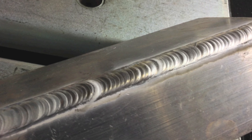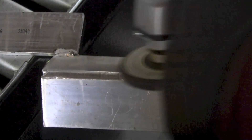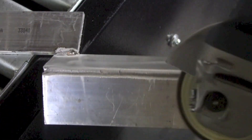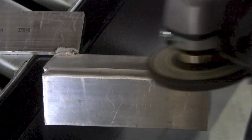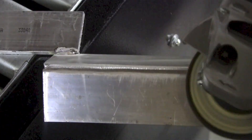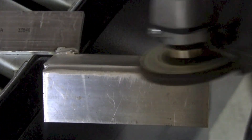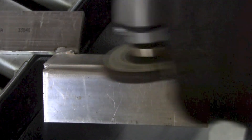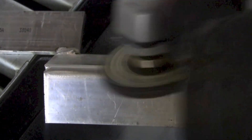There's the weld, and there's a restart about two inches in from the end. Next I put the Pearl Maxi flapper disc on — 60 grit — and went ahead and radiused over the outside of the weld. One of the key things when doing a radius or finish on a long weld like this: we don't want to dwell in any one spot for too long or it'll make it uneven, cause a gouge or a ripple. Keep going back and forth, not concentrating on any one spot, constantly changing so that we don't dwell and put a flat in there.